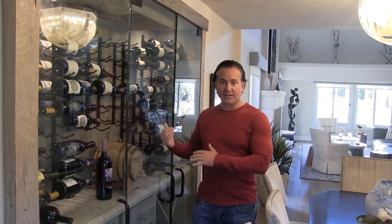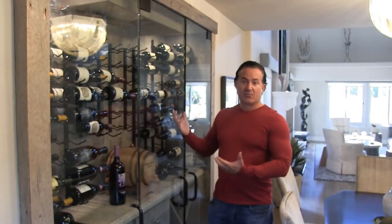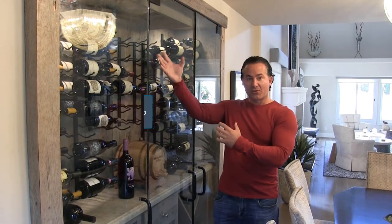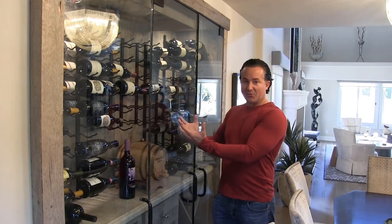When you have an oversized unit, you're producing more humidity, and when there's more humidity you're going to get more condensation. So there are issues with condensation, mold, and air gaps. When we opened this up, you're supposed to have proper insulation, but they had fiberglass insulation used in regular walls — no green board, no vapor barrier to protect from heat and cold coming in. With an oversized unit, you're going to produce condensation and mold.